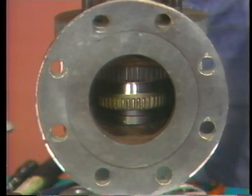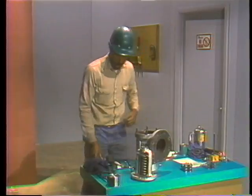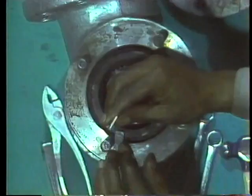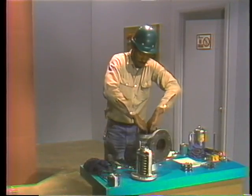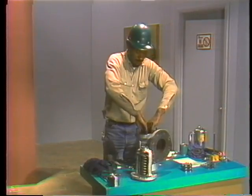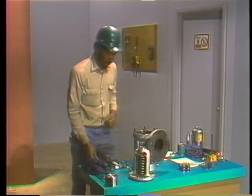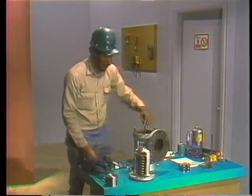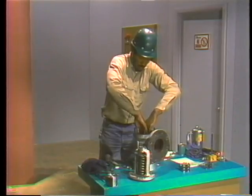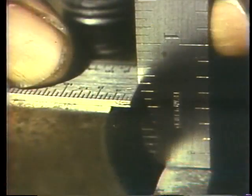His first measurement tells him that the ring is too close to the top of the valve body, so he turns the ring clockwise to lower it. He then repeats the measurement — the ring is still too close. As you can see, positioning the upper ring is largely a matter of trial and error, but no matter how many tries it takes, don't settle for a near miss. Installing the ring in its original position is essential for reliable operation of the valve. Bullseye — five-eighths of an inch exactly.